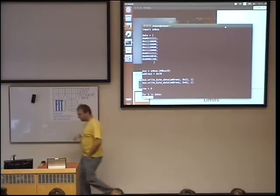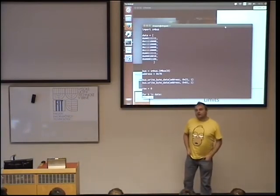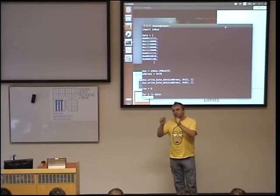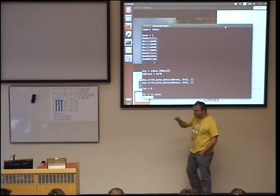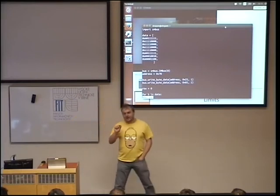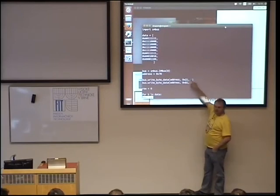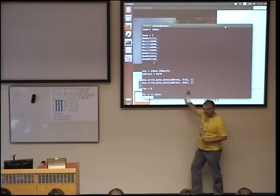If I go down. Is the value binary? Zero or one, or is it a byte? It's a byte. So you need to check the documentation what to write there. By the way, this display I'm using here works a little different way. So this first command is start the oscillator. Second one is start the lights. And it doesn't matter which value you send. It's enough just to touch the memory cell. But more common is that you write some value with some meaning to some memory cell.